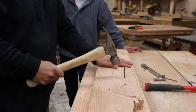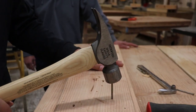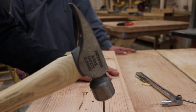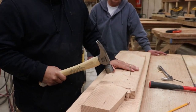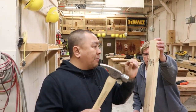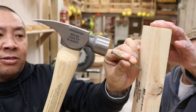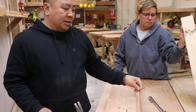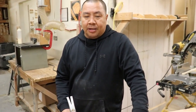If your hand is coming straight down, you want the nail tight and straight. Ms. H, bring that hammer down and leave it so everyone can see how the hammer head is sitting relative to the nail. If there's a discrepancy, especially with a smooth head, you'll slide right off the end of the nail and bend it. If you're nailing on a wall, your nails tilt up — angle them high a little bit. This will only come with practice, but we want the concept understood so that when you get into the field you've got a head start.